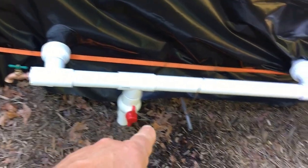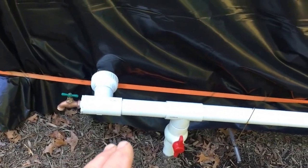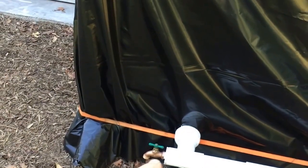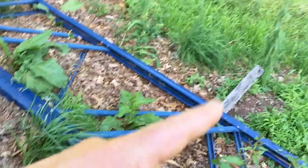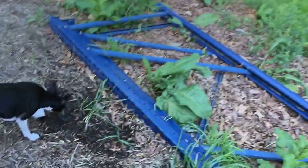Then I'll go into a two-inch to four-inch transition, so instead of two-inch plus two-inch connecting together, I'll have two-inch feeding into four-inch from this system and two-inch feeding into four-inch from that system. That gives me four inches feeding into the overflow. I'll come up over and down with the four-inch pipe somewhere in the center, then feed it out this way. Eventually I'll have a swale here to catch any water and hold it on the property a little bit longer.